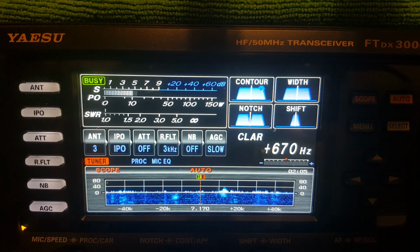I'm almost speechless, because I wouldn't even expect to hear you on that 40-meter end-fed. So that's a half-wave end-fed, 64 to 1. So you're up around 3,000 ohms approximately then. Yeah, QSL, yep, QSL.